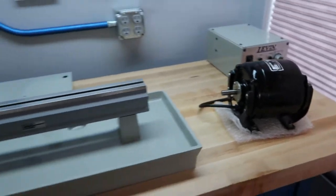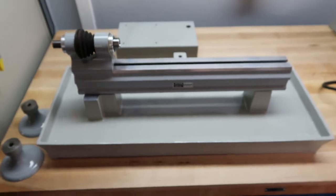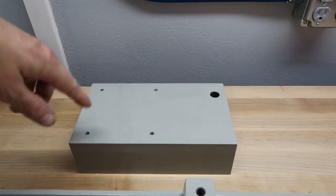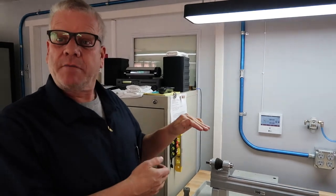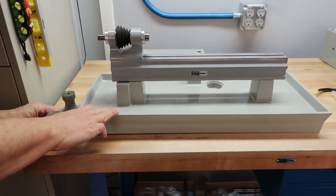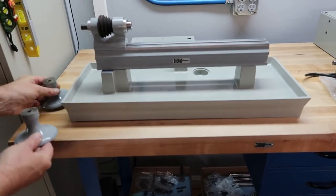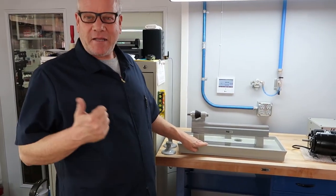Here's the open headstock. Luckily, both of these have chip trays — they're rare because they don't make them anymore. These motor mounts have little tracks that allow belt tensioning but do not allow side-to-side alignment. So you have to have your motor box screwed through the table precisely to the headstock without any gap. This is what you'd mount on if you don't have your chip tray. On this older one, the risers are actually built into the chip tray. On the more modern lathe, they're part of the actual lathe bed.